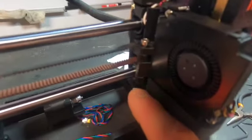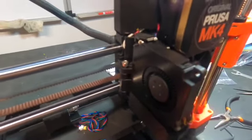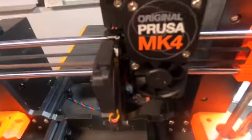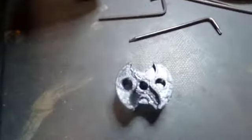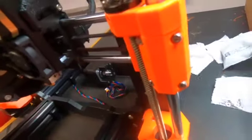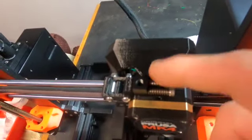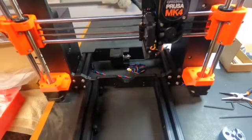It's supposed to move freely. These prints - a lot of the small prints on this job - I continue to hope that the printer does better. This part is actually a tool used to help with the assembly of the extruder. The bottom looks fine, the sides are okay, but you can see the ringing going on. Here's a good example - you can see more ringing from the printer on this part.